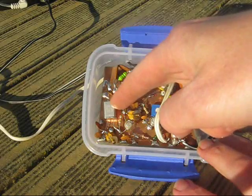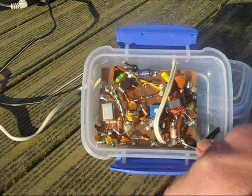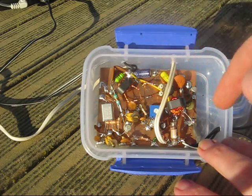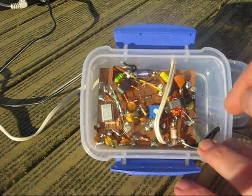Inside you've got the crystal oscillator just below 10.140, there's a 2N2222. It's again the circuit used by W3PM. There's a balance modulator — just two diodes — another 2N2222 as an RF amplifier, and the final stage uses a BD139.